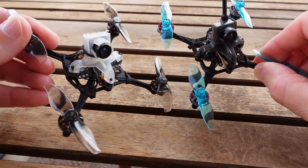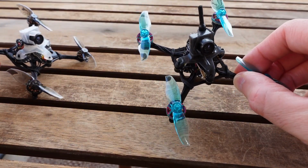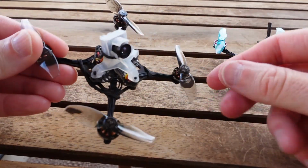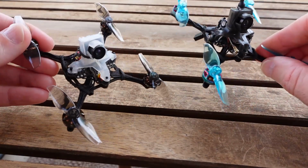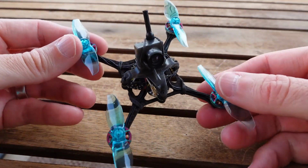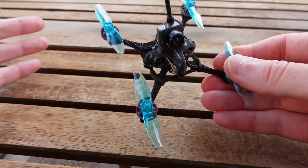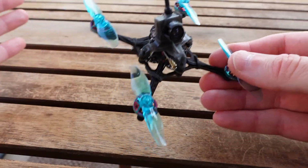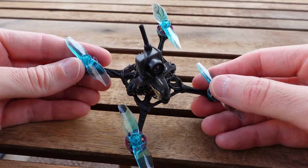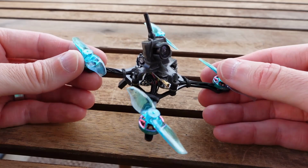Initially I thought, well, is it the motors or something else? I flip-flopped the motors, crossed those over, and it persisted: the Flywoo board was only hitting 36,000, 37,000 versus the Tune RC board with the Flywoo motors still hitting 41, 42. So it's not a motor issue. I've tried ESC settings. It's not an ESC settings issue. And I've tried taking the PID loop out of it. If I look at the blackbox, there's not just one bad ESC holding them all down. They're just all consistently there, hitting max motor command. And when you spin it up in Betaflight, without any PID loop involved, I can't spot any problems there.